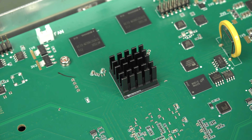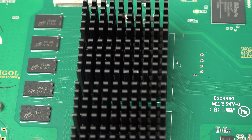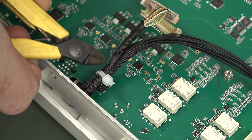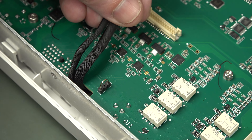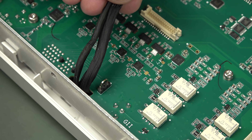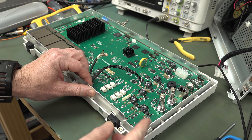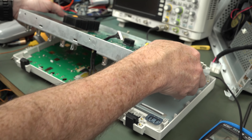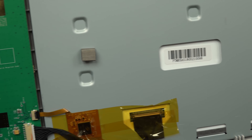Following the boot code, it turns out this applications processor is actually a Xilinx Zynq processor — a combined FPGA and ARM processor. A very powerful beast that we've seen power entire scopes before, like the low-end ones. But in this case it just looks tiny compared to these custom ASIC beasts. It looks like the board just won't lift out on its own — you've got to take the entire metal cage out first.